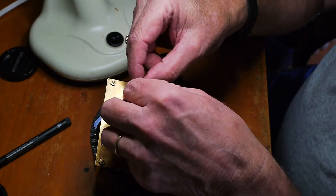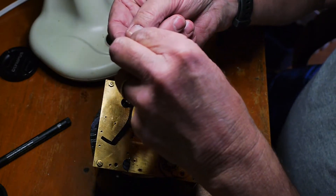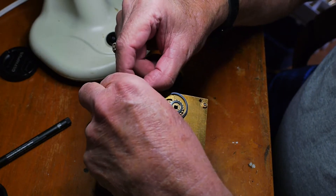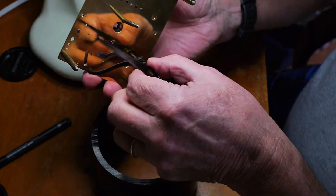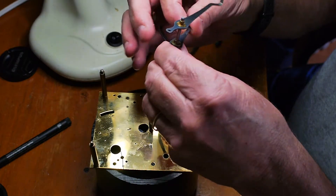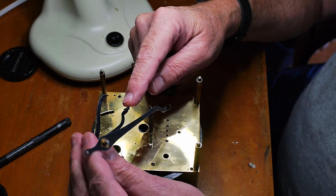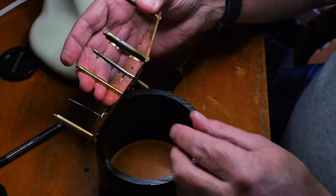I think that's probably the only thing we have to take off. We take this little thing out here — we lift this — oh, there's a washer here, so we're going to remember to put that back on. And then we have a stop lever here. I don't want to do anything to that spring, so we'll take that out. This thing comes out. So now we have the front plate. This is the lever — these are not adjustable, so they are what they are. The stop lever goes on this; this goes on the cam; this goes in the deep slot of the counter.